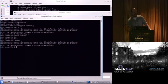You could. There's a couple of nice things about the Xbee and ZigBee stuff. One of the things is that it's out of band, right? Even though they're using 2.4 gigahertz, they're using different channels. So if I pull out my Wi-Fi analyzer, it's not going to say, hey, someone's over here on channel 2, and that's a big advantage. If they happen to be using Xbee, if it's a manufacturer, they might be using something like that. Just make sure you pick a different channel, and no one will probably notice. But yeah, you're right. There could be other mechanisms, but for various reasons, this is one possibility you could use. Any other questions about that?